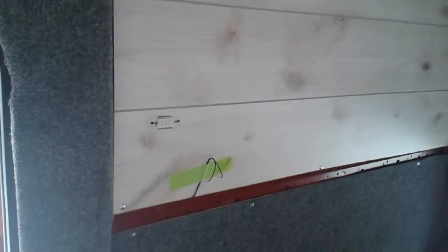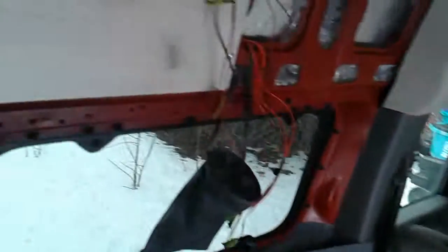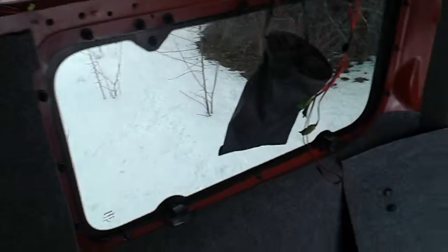So this is part three — it's coming along pretty good. Wall board up, ceiling board — this will all be covered too. I haven't quite figured out the exact look yet, but I've got an idea I'm gonna try. All my electricals are in, all my lights are done. These pigtails here go to lights that are gonna be underneath the bunks in the storage area where the ATV will be, so I can have light there as well. And then I'll have a red light up on top of here. All my switches there — this is pretty basic.